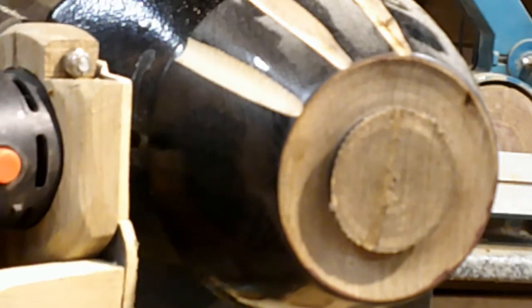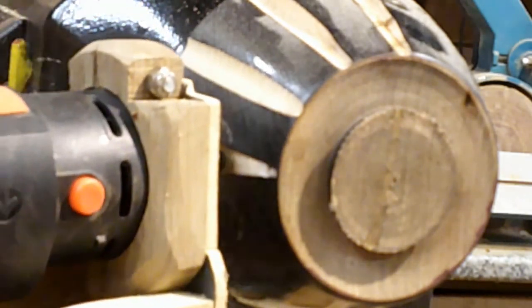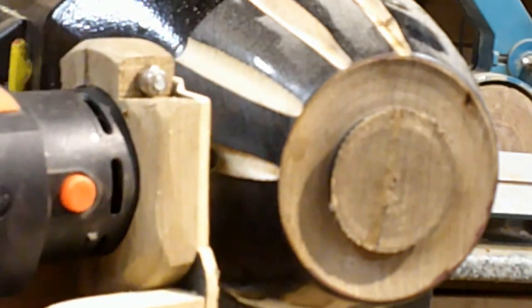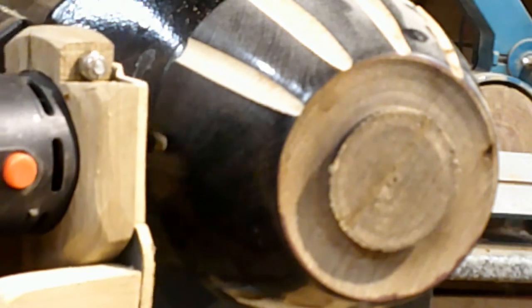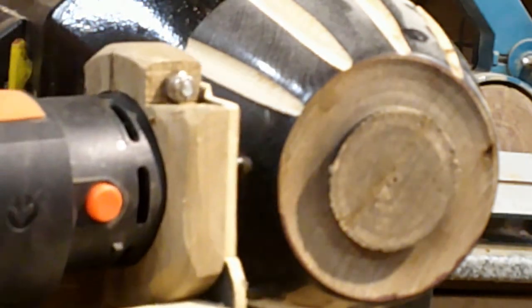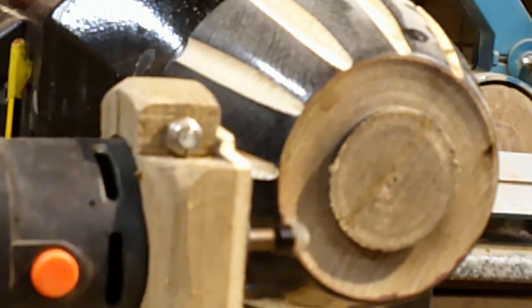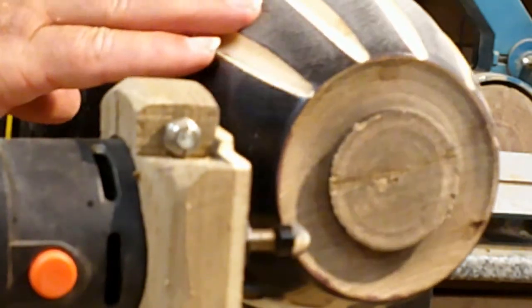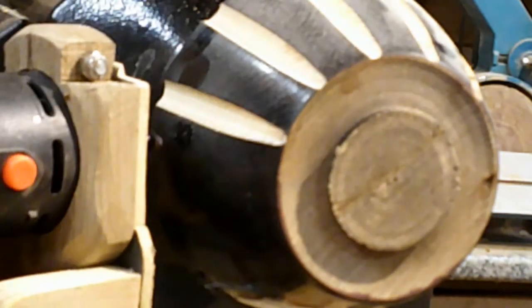You can see there's a router. I've got a ball nose router in there. I think that's probably about 3/8, something like that, 6mm. And you can also see that there's a small router that's sat in there. And all I've done is I've made up a carriage to hold that. It was a piece of beech I turned just to fit over the nose of that router.